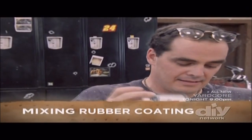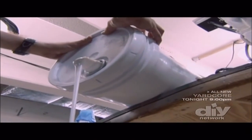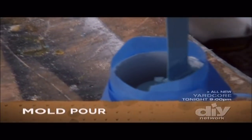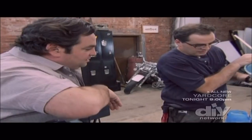Spill it out. Nope. What are you doing? Are you okay? You were like, the paint is nothing, and now you're lightheaded. You're holding the thing sideways. This is Catalyst. We'll pour this into there — it's a 10 to 1 mix. And then what I'm going to do is brush it on so that I capture all the details. This is just the mold making detail coat. The silicone rubber mold making material. Is that making you hungry, John? Yeah, that's like the world's biggest thing of fluffernutter.